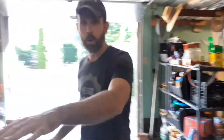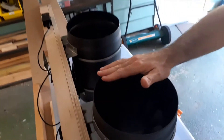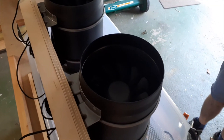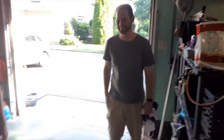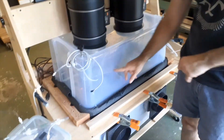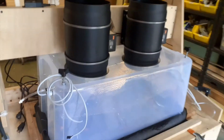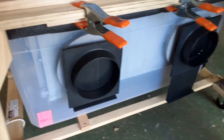We've got air handling here — these big fans will push as much air through here as we want. They're normally used for ventilating hydroponics. Also joined by Open Air co-founder Matt Parker. The fans push the air, this diffuser spreads it out so it passes evenly through all the sorbent sheets, which hopefully grab the CO2 off of it.